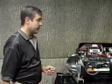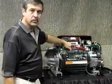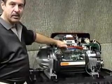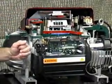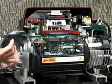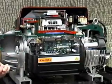The first advantage we'll talk about is the reliability of this compressor. The TurboCore incorporates simplicity into its design. For example, the TurboCore itself has only one moving part, and that's the shaft. The shaft is levitated within a magnetic field, decoupled from any internal components. Neither bearings, shafts, or seals come in contact with the shaft. This, in itself, would extend any compressor's life.